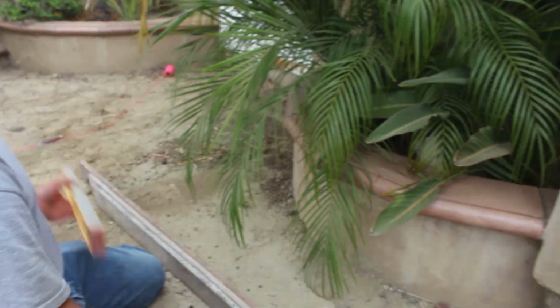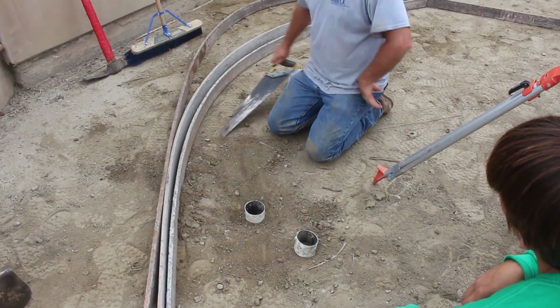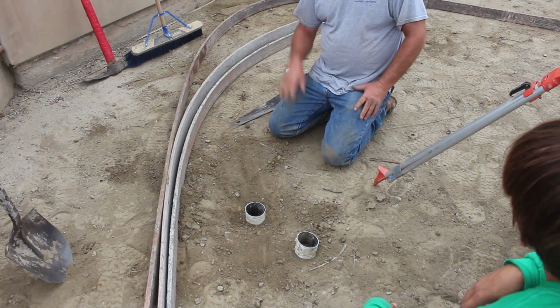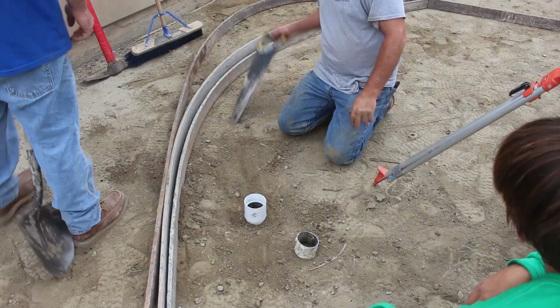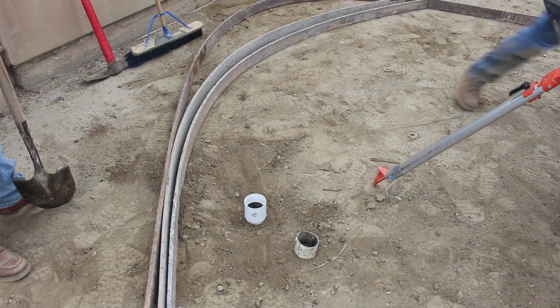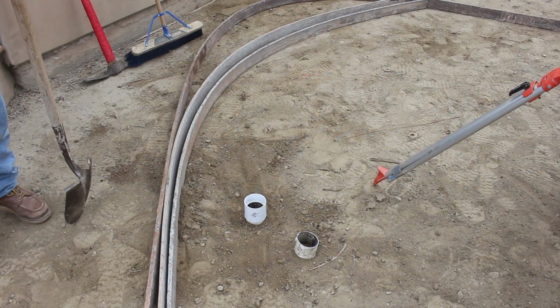because they've got this one raised planter wall over here to my left that is pretty low. You can see it over there in the corner. We had to have the concrete below that precast concrete cap that's been stained and sealed. We've got to get the concrete below that or it's going to look funky if I pour up against that bullnose cap on that raised seat wall. Well, it's not really that raised at this point, but it's there, so we've got to deal with that.